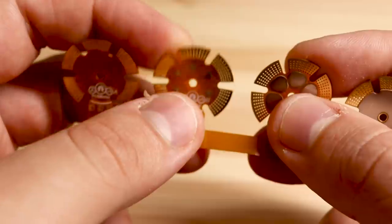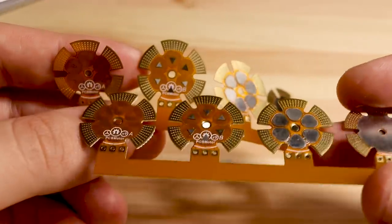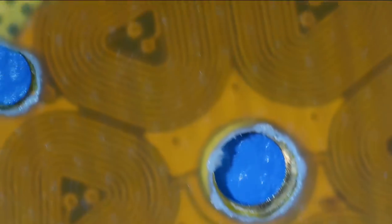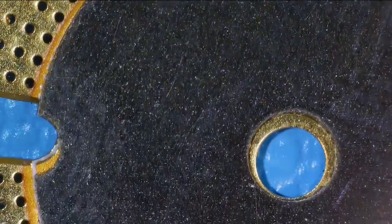These three designs could still bend, so to avoid the issue observed in the stepper PCB motor I also made an alternative with an FR4 stiffener on the backside. The stiffener appears to be hand assembled — some were slightly misaligned — but this shouldn't affect us that much.